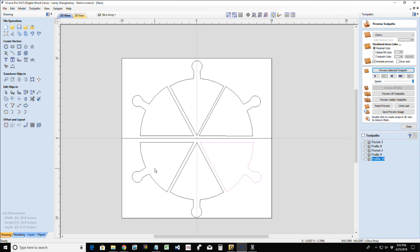Tiling doesn't... Howard, for tiling, it doesn't help me, because I'm still cutting them out of two 10-inch pieces. I don't have a 20-inch wide gantry space on a mini carver. Okay? So I'm still breaking the board in half. So there's no sense in tiling, because I've got plenty of room this way to cut on my X-axis, so I wouldn't have to tile anything.